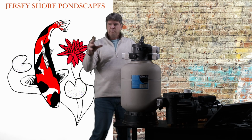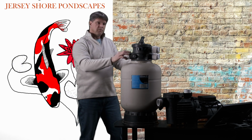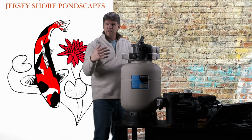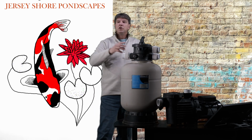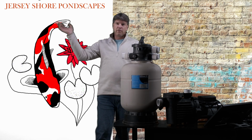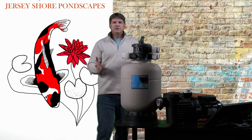If you're picking out a pump, you want to be in that middle range, right? You don't want to be too slow through here because you need to turn enough water volume over in your pond, but you don't want to go too fast where it's just going to spit all the crap back out again. All right?